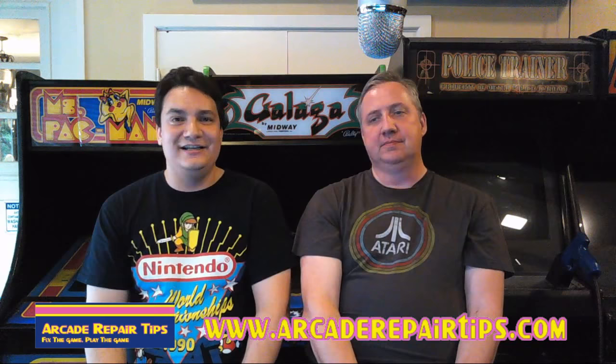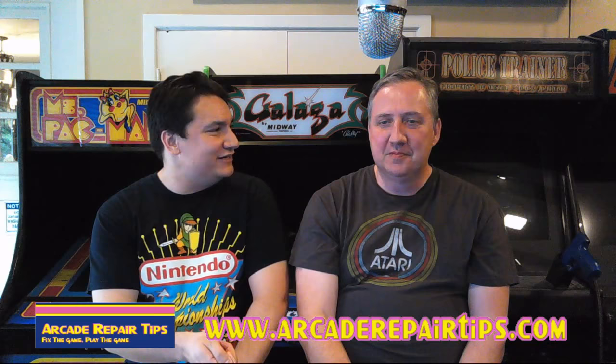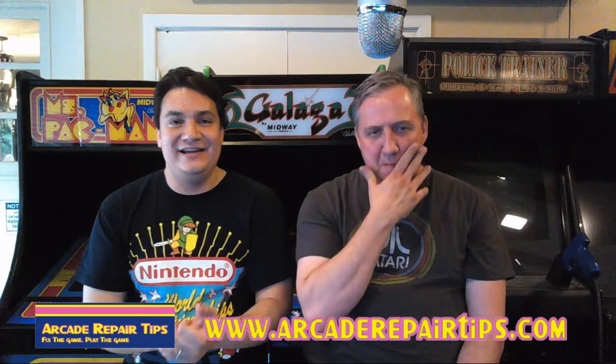Yeah. And so this is probably why you're playing blind, right? Yes. It definitely does not work very good with that unplugged. Oh, okay. You know this from experience? Yes. Okay, and I know I've told the story about the time that you left the monitor plugged in and I stuck a screwdriver under there to try to discharge it, right? Yeah, probably so. We told that story before? Okay, just making sure. But yes, Cosette, what you have there is the anode cup that goes to the flyback on the monitor. This is the high voltage section of the monitor.